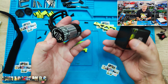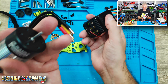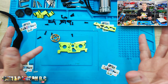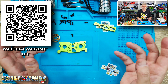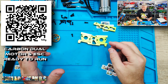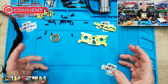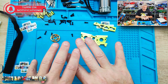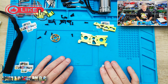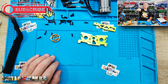Please, once again I cannot stress it enough — make sure that the kit you buy has the correct motor and the correct ESC. If that's wrong, there's going to be an imbalance in the voltages and you're going to end up frying one or both of your motors and ESCs. I'm not going to attempt to fit this now as I'm not ready, so that will be on the next video. I just wanted to show you guys what you needed if you wanted to get that ordered. Thank you so much for watching — hit that like button, subscribe to the channel, and I'll catch you next time. Take care, stay safe, bye bye.